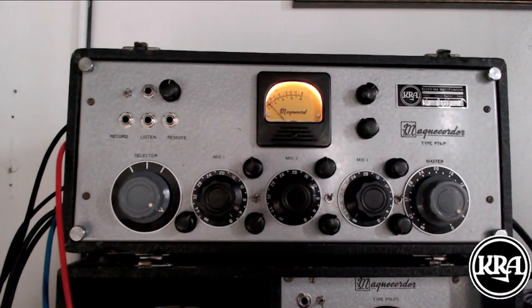So in theory, if you've got a project, and it's kind of what I built this mixer for, where you're recording a small ensemble to a stereo mixdown that you're printing to tape or a digital whatever. The idea is that you're going to commit to this stereo mixdown. And if that's the case already, and you don't need the effects send because you're recording in a room with reverberation or whatever the situation happens to be, and you'd rather have a fourth microphone preamp than an effects send, there you go.